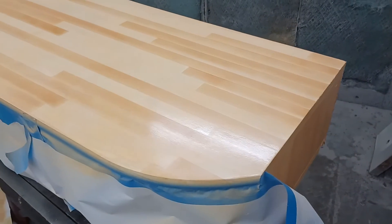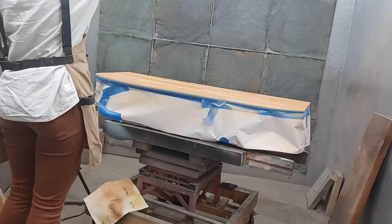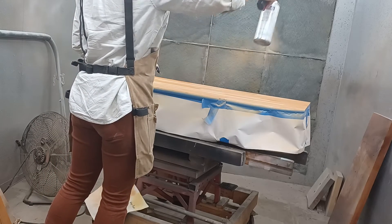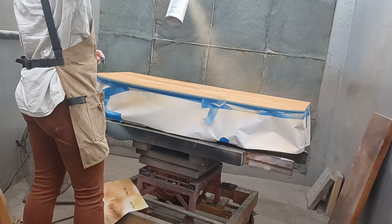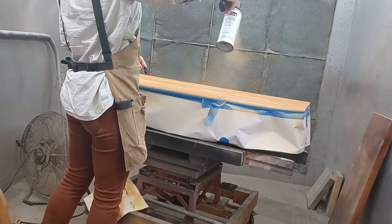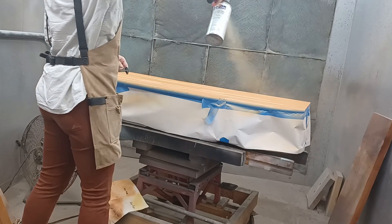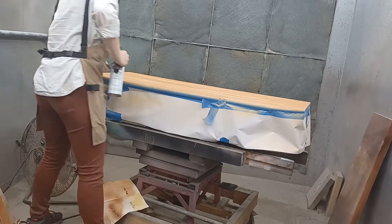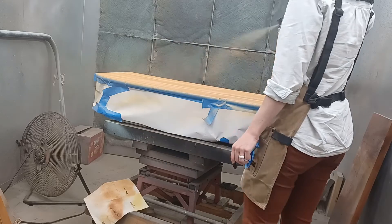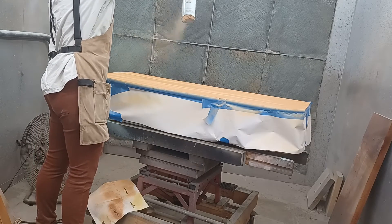The next stage is when we fog a color on the whole piece, and you're going to see how we pull it together. This is where we decided to stop — that does not look too good, not at all what we're looking for. So repair tech Melanie is going to fog some warm tan on, doing this by eye. You can see how far away she is, just shaking that hand, letting it settle. It's an uneven spray — she's high in one spot, low in another, watching her color. This is very hard because you're squeezing the trigger and the color's landing there about 10 seconds later, so take your time and sneak up on it.